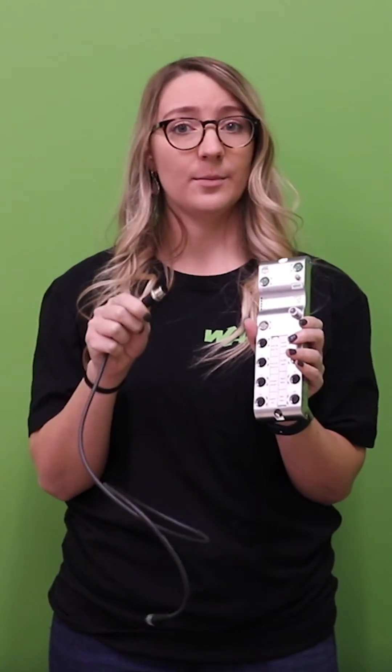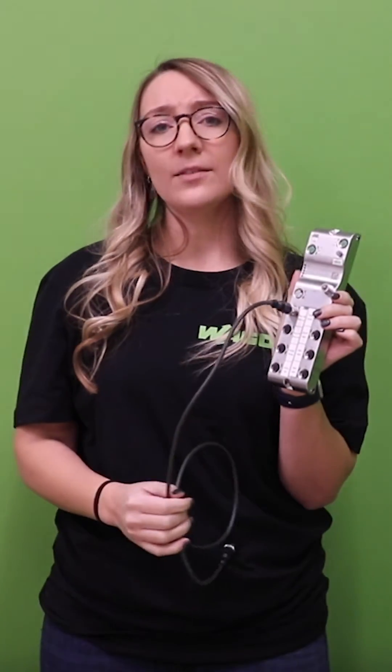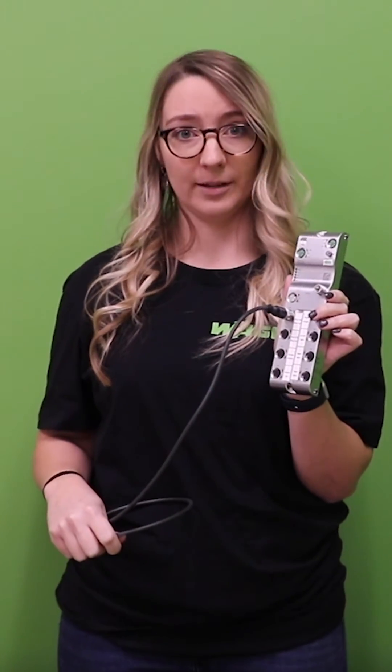Let's say your network has a mix of digital I.O. sensors and I.O.-Link devices. You can use our lightweight, non-encapsulated I.O. system field as an I.O.-Link hub. You then hook up the I.O.-Link cable to the I.O. system field master, sending all of the information from the hub through the master to a PLC, PC, or web server via Ethernet-based field buses.